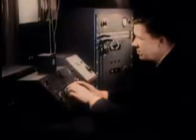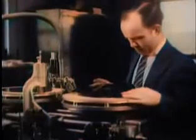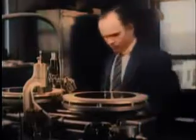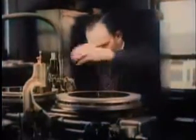In the monitor booth, the sound technician listens to the rehearsal through a loudspeaker and in cooperation with Maestro Ellington, brings the music to its highest sound perfection before transmitting it through the electrical circuits to the recording machines. Preparations for the recording process begin. A disc, a celluloid-like substance revolving on the turntable, gets ready to receive its musical impressions. The recording stylus is lowered into position to inscribe its musical message, waiting now to be galvanized into action by the electrical vibration produced by Ellington's music. And the signal goes out already.